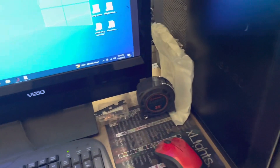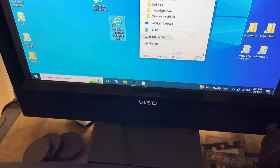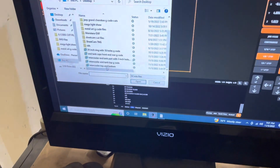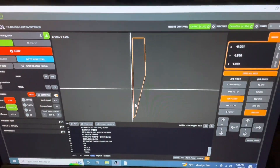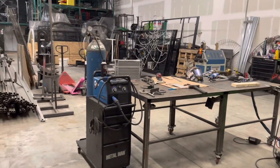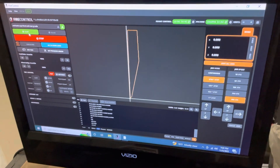Making a mess here on the floor because I'm at a water table. Pop this guy in here. Pull up this file — front and rear in Fire Control. That's what I had drawn up in Fusion 360 and we're going to do our first test cut, get this guy ripped out. Once that's ripped out I'm going to do a test fit, see how that fits on the end tanks. And if they're good, I'll rip out three more and we'll be good to go. Program's loaded, table's squared off.